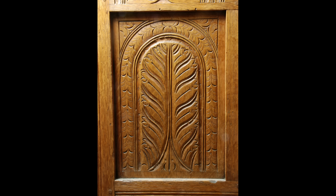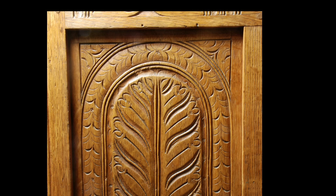I've switched to a still photograph to look at the details of one of the panels from a related chest. When I get to the carving I'll give you all the details, but here I just want to show you how it's composed. It's clearly related to the lunette — you see the v-tool work for all of the outlining. In the arch itself, instead of Alexander's marble run, which is a concavity, this is a convexity. He outlines it with the v-tool and then bevels down to the depth of that cut to create that convex surface on the arch, decorated with trios of gouge-chopped inverted V's or seagulls. Every third one has a chip behind it for more shadow.